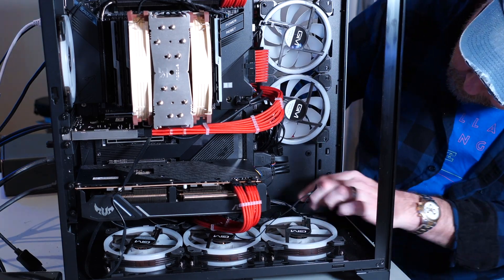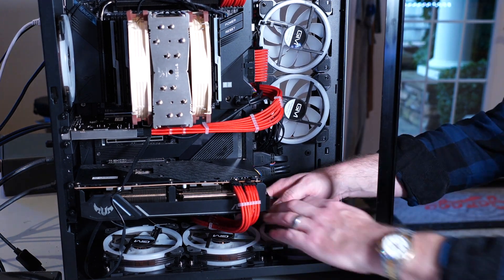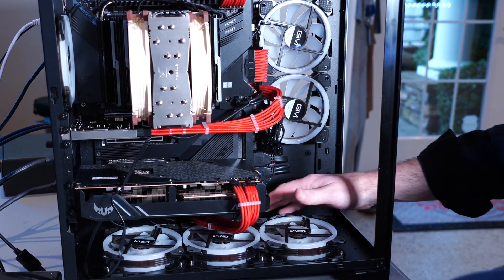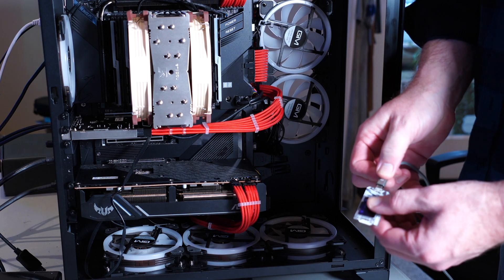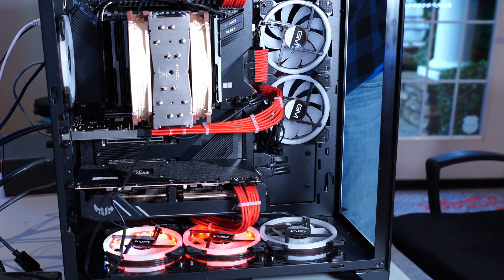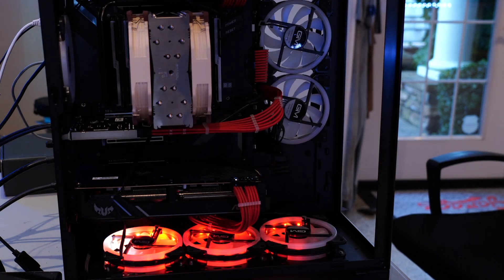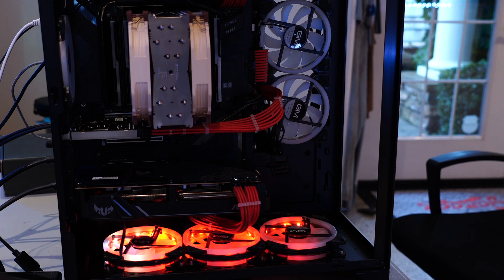After the fan power is routed properly, it's now a case of routing the three wire sets from the fan LED connectors. It's somewhat more complicated because they're interconnected where data in goes to data out, but nothing rocket science can't solve. I'm going to drive the LEDs with this Heltec ESP32 module and source code from one of our later episodes in the tutorial series. I get some action immediately when I plug in the cable because this PC is set to have USB ports powered even when turned off — I'll change that so they only come on when the PC turns on. Stay tuned for a demo of about a dozen different effects, sometimes as quick as two or three lines of code each.